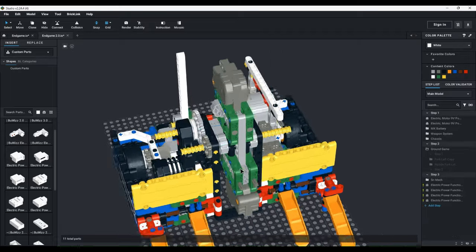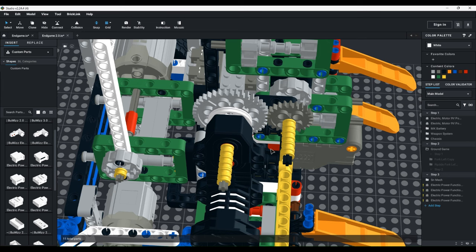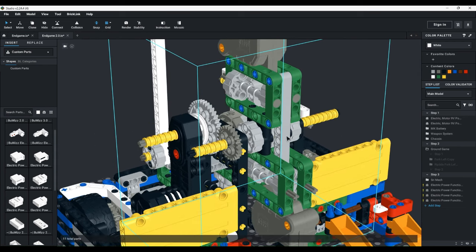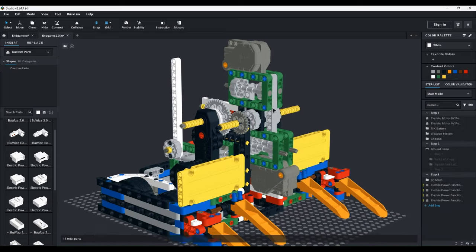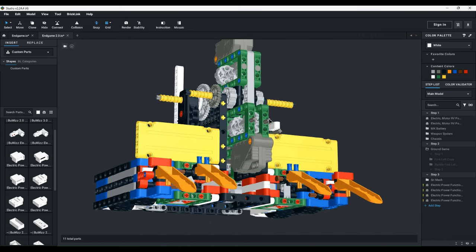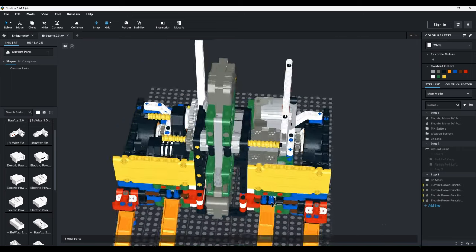The weapon system moved from the left side of the bot to the right side, and it's still using a third-party buggy motor clone. But this time, it's a 1.66:1 gear ratio, so still geared up, but it's not as fast. And then the weapon also changed, so instead of using the atrocious slabs from Endgame 1.0, it swapped to these wind-up motors. I was trying them out for bar spinners, and they worked pretty well. The only issue was that you couldn't really mount a sharper tooth on it, so you kind of just smacked people with the rounded edge of these wind-up motors.